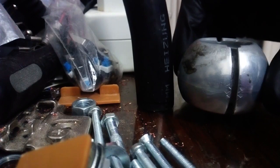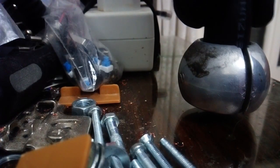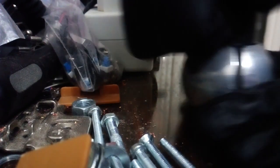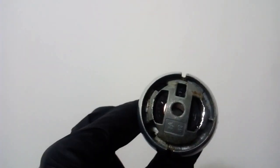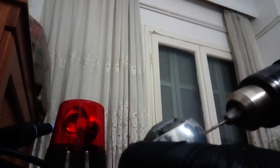As a first step, we have our pieces put together, and since our new neck has an inner metal core, we can now secure the head on the new neck with something metal, like a small metal rod or a screw. I chose the metal rod. These two grooves to the side of the head are very convenient since they are diametrically opposed. This helps us drill holes in both sides, which we can utilize as we wish. The peeled out plastic of the head also helps a lot. This broke apart quite a few years ago.